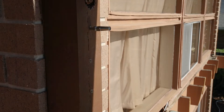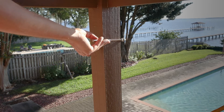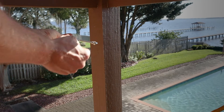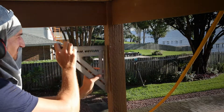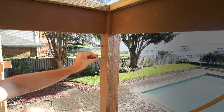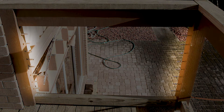Note: it is important not to tighten the compression caps at this point — I learned this the hard way; more on that later. On the opposite post, I install the studs that go through the entire post and provide the ability to tension the cables. I use the same template to mark stud locations, then drill through the entire width of the post using a bit the same diameter as the stud fittings. To keep the hole straight and plumb, I used a speed square as a drill guide. The studs come with nuts and a washer that need to be removed to insert the hardware through the post; on the other side I replace the washer and loosely tighten the nut and cap nut for now. I repeat this process for all cable studs.